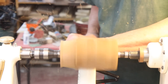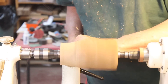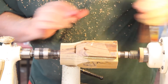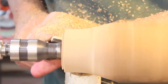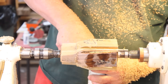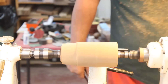In some of these early clips I've got the film speeded up quite a bit — it's not all that interesting. I'm just taking this down to round to get into the serious turning. The first part I'll do will be the top; this is the end I'm going to take the top from, and this is the base of my little project. I'm going to put a tenon on here that'll fit one of my smaller jaws — establishing a tenon or spigot for my scroll chuck. The jaws go down to about an inch and an eighth. I'll also establish a tenon on the other side of the piece.